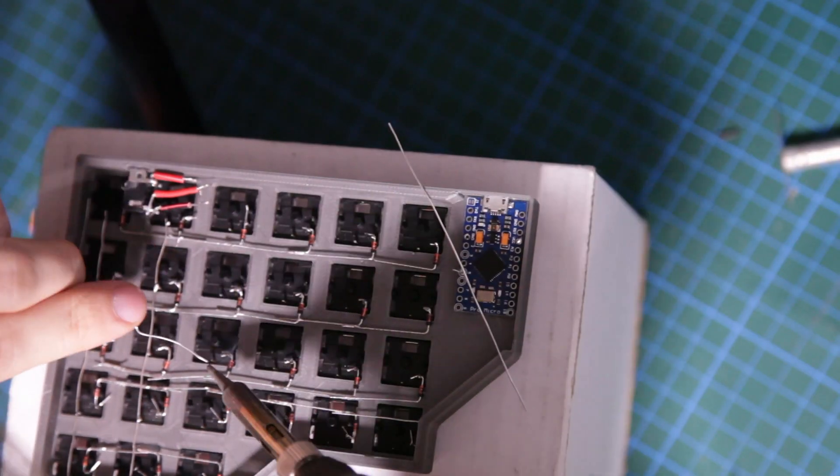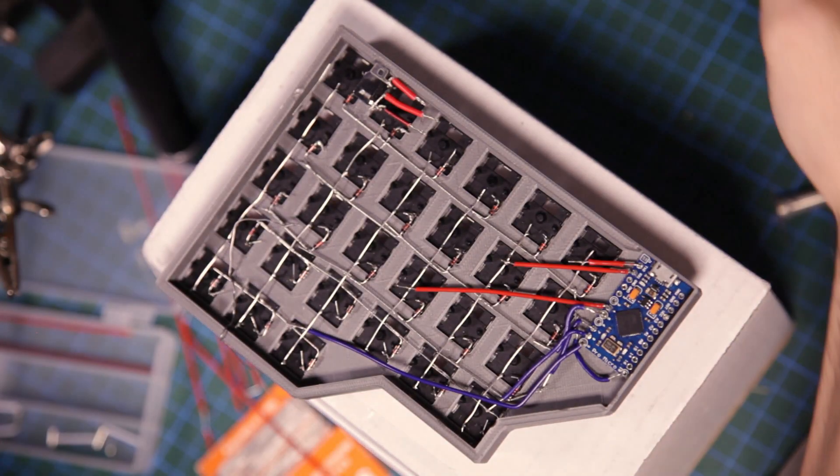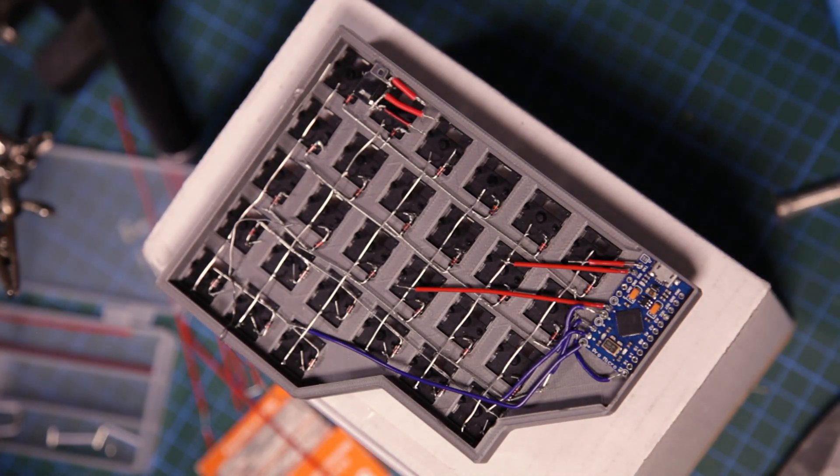After wiring up the rows and columns, you just need to write down which row and which column you connect to each pin on the microcontroller, so we can choose the mirrored pins on the other half. Then I connect the TRRS jack to the I2C pin. I read somewhere that some people had issues with hotplugging the keyboard halves together, needing to reset by unplugging and replugging the USB cable, but I've never had any issues with that on my keyboard. If I had known this works so well, I might even have added pins next to the magnets so I can use it in Planck mode without any additional cables.